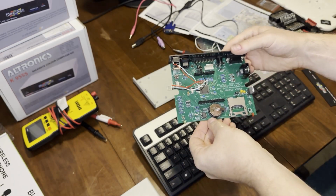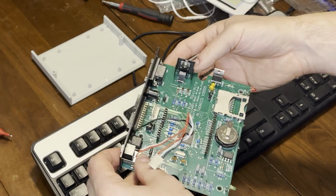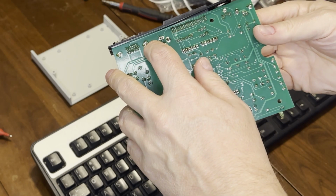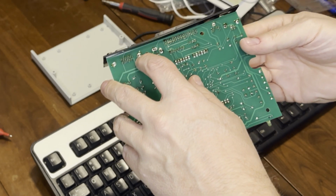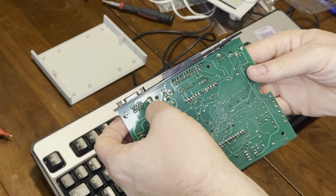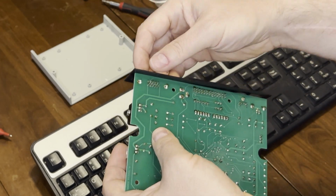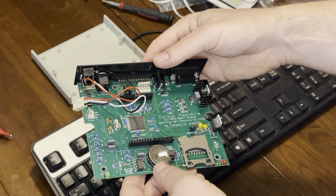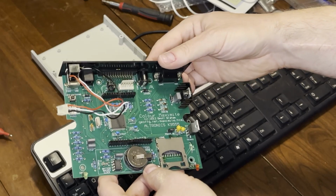So a couple of annoying things I found on this project. On 2 of the 5 kits, the VGA connector was missing the plated through holes, which by itself isn't a big problem, except the ones that were missing the plated through holes, also the spacing was not quite right to fit the VGA connector. I had to struggle to fit it in there.